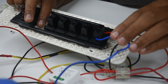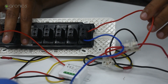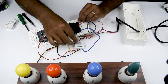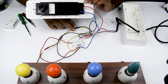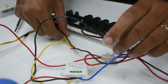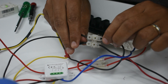I've given a connection from S1 — this blue wire from the module — to one side of the switch, and similarly connected live from the module to the other side of the switch. The switch connection and the module connection are now done. The only thing remaining is to ensure the neutral wire of the appliance is connected to the neutral terminal appropriately. This black wire coming with the yellow has already been connected to the neutral terminal.